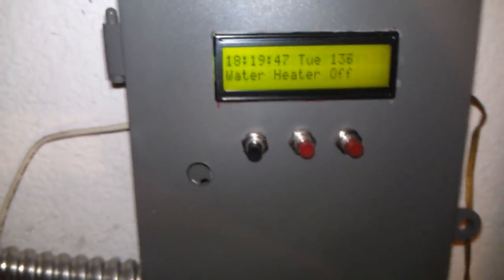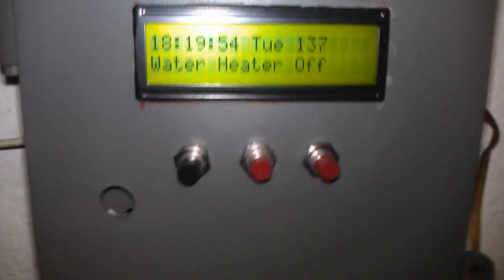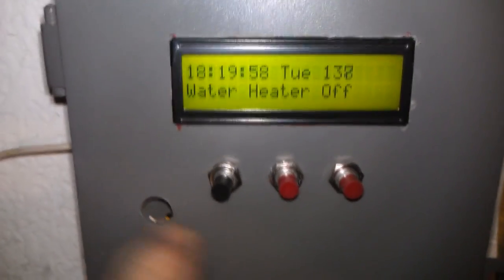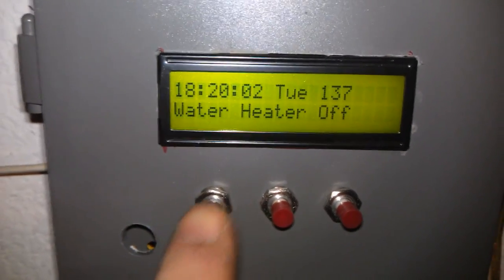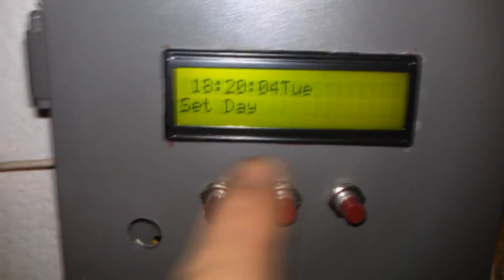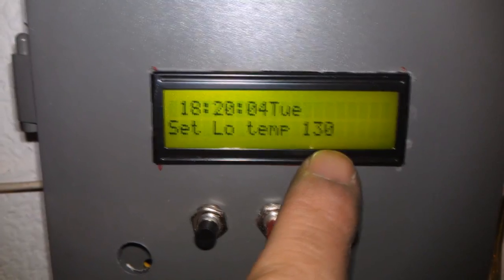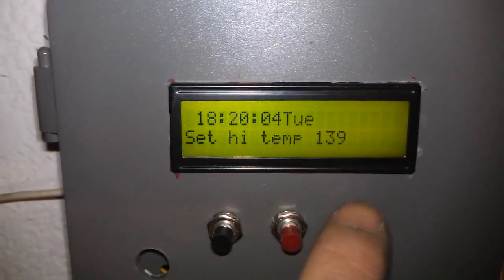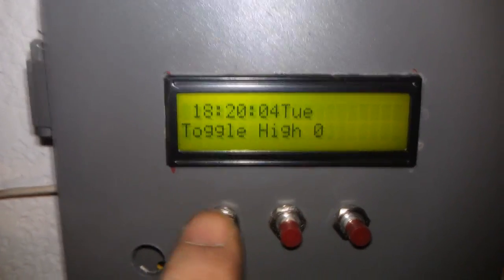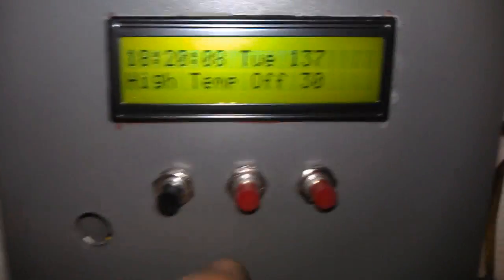The water heater, unfortunately, is already cranked up in heat — it's really hot. That one is pretty much agreeing within about a degree of mine. Right now it's off at 6:19; temperature is just too high for it to be on. This is my Mode and these are my adjusters: set your hour, set your minute, up and down like that. Set the day — it's Tuesday. Time on at 7 p.m., on at 7 a.m. The low temp — normal — is 130, something gives it to 130 and it's going to shut off. High temp I got cranked way up to like 139. Toggle high — this is how you can toggle the high. Then I'm going to go ahead and exit. We're running high temp mode but it hasn't dropped below the setting minus 4 degrees, so if it's set for 139, it has to go below 135 for it to come on.